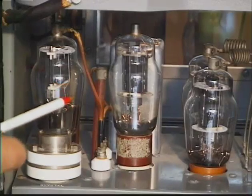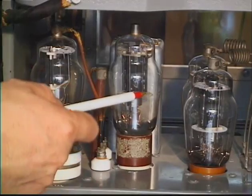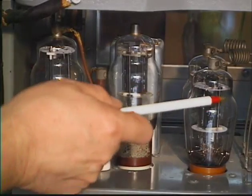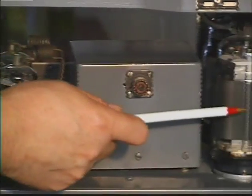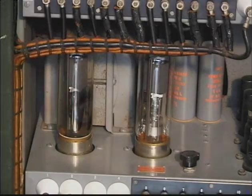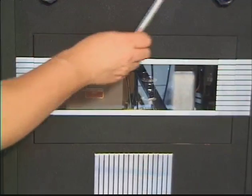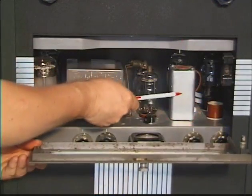The 30J18 used an 802 crystal oscillator stage feeding either an 807 frequency multiplier or a pair of 807 buffers, selectable, which drove the push-pull 813s. The modulators were a pair of ZB120s, similar to 838s but zero bias. Plug-in coils were used to set the desired frequency range, then tuned with trimmers or sliders to resonance.